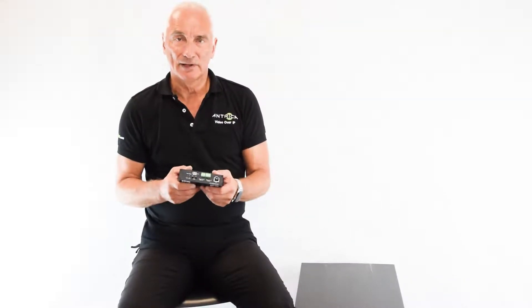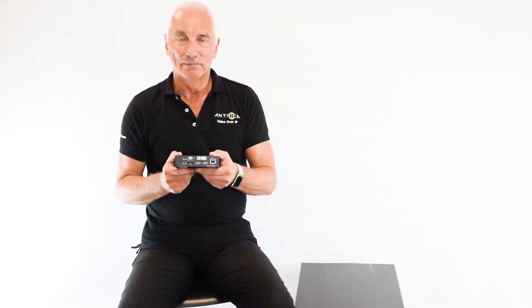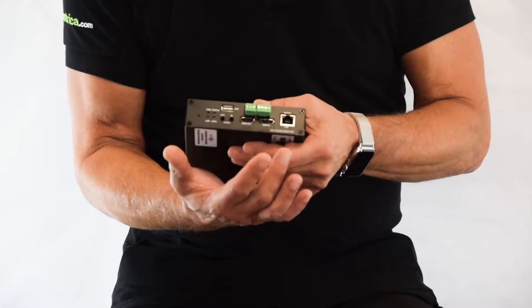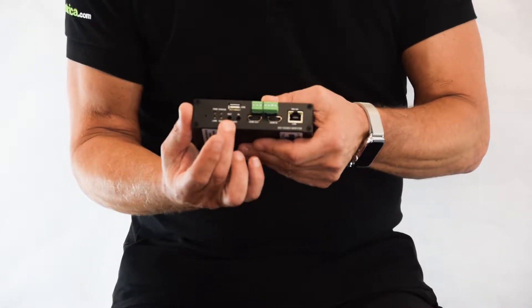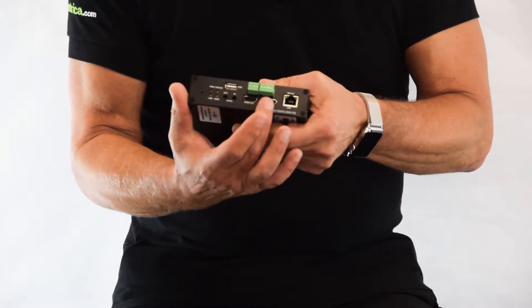So this is the ANT 35000H, as you can see, a small desktop box. The product has HDMI inputs and outputs, which allows it to be connected to any HDMI source up to 1080p60 and to stream this with a fully OnVif compliant stream complying to OnVif Profile S and Profile G. You have an Ethernet port which is also a Power over Ethernet port, and we also have audio in and audio out.